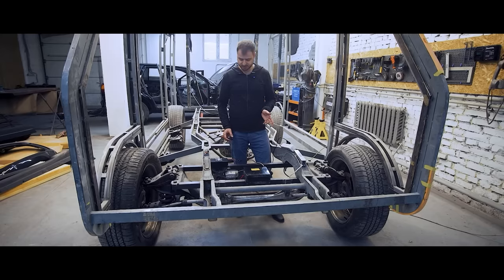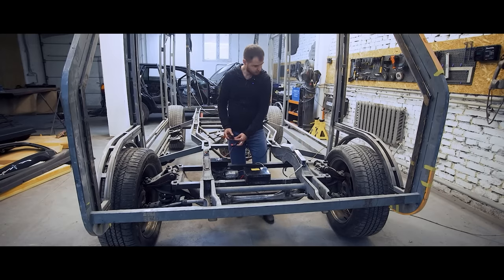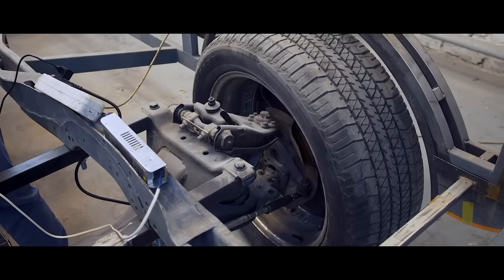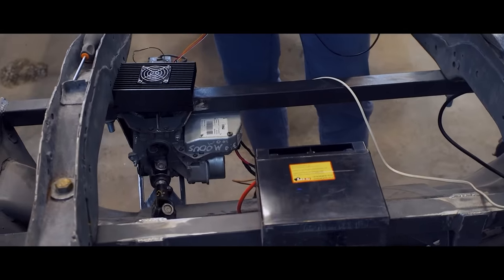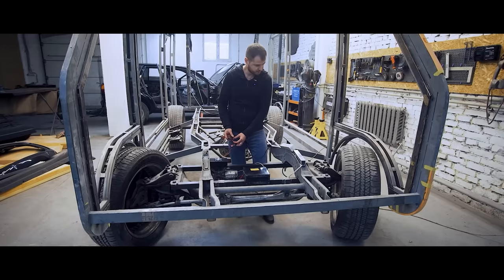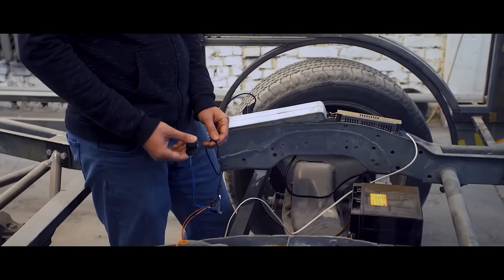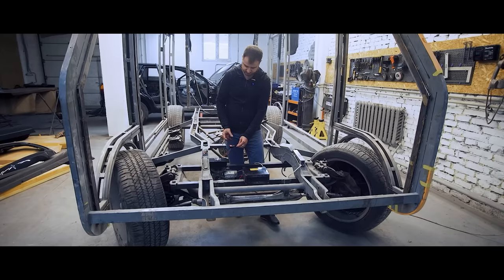Let's test our system. We have Arduino, joystick, and stepper's driver. The 12V battery powers the steering assist. The power unit powers the stepper's driver. Now we're gonna turn it on, let's see how well we can steer. Okay, here's the limit, let's turn it the other way. Great, full range. It's not the final version, we're gonna have a program with an encoder that will monitor the turning number, the central position of the wheels and other stuff.